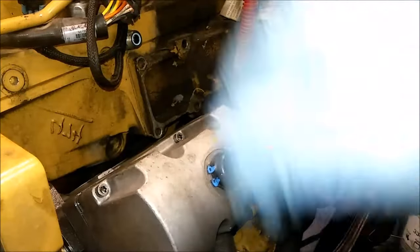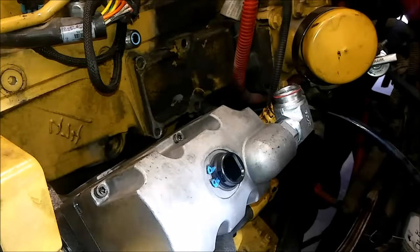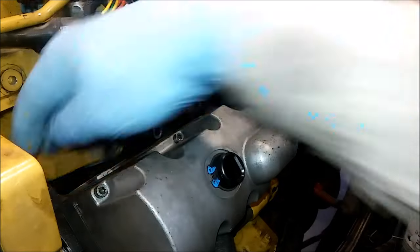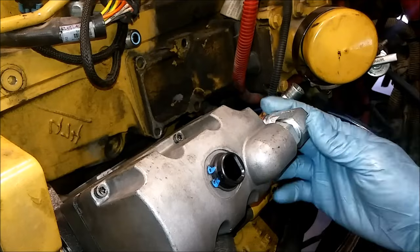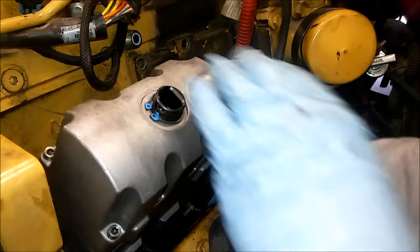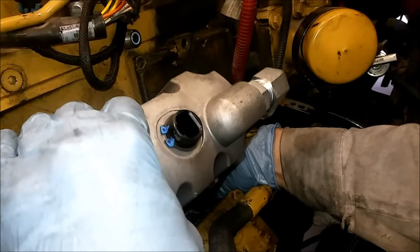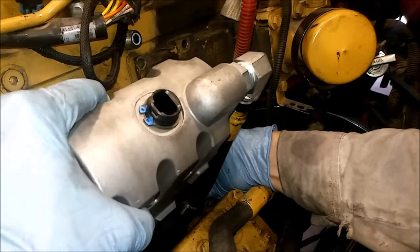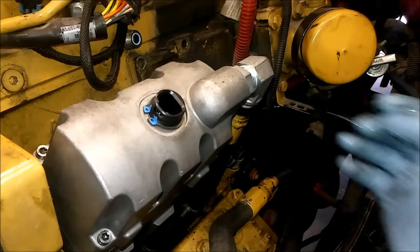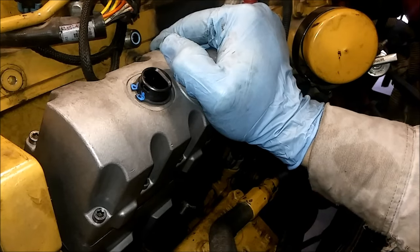The area is tight for getting them in. Some trucks that do not have air compressors — this is twice as easy as doing it with the air compressor. I'm inspecting now with my light for the O-ring on the front of the pump. They're pretty good about staying in place, but I always like to make sure, because the last thing you want to do is have to pull this pump off. I've still got my fitting loose, and I'm going to stick the line into the fitting. Once the line's in place, make sure it doesn't pop back out. Then we're going to get the gears to mesh with the gears in the front structure. These are not timed — you do not have to worry about getting the engine on top dead center or anything. Just insert it in and make sure the gears are meshed. Once they're in there, I always give it a quick glance to make sure the O-ring didn't pop back out before I put the bolts in.